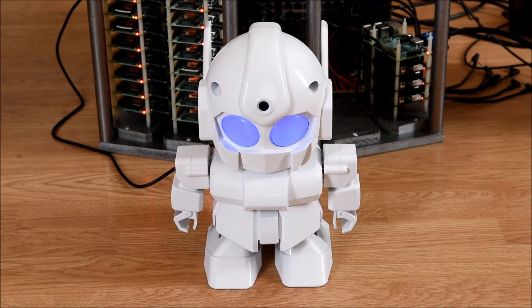The main purpose of this project was to build a supercomputer to act as a robot brain. Rapiro was the first robot I wanted to use it on. I had installed a Raspberry Pi 3 and a Raspberry Pi camera inside Rapiro's head, and I had to build a small 5-volt power supply to power them. My plan was to control Rapiro wirelessly from my supercomputer. But unfortunately, my power supply was getting way too hot, so for now I'm having to connect Rapiro to the supercomputer with a USB cable, and I had to remove the Raspberry Pi and camera.